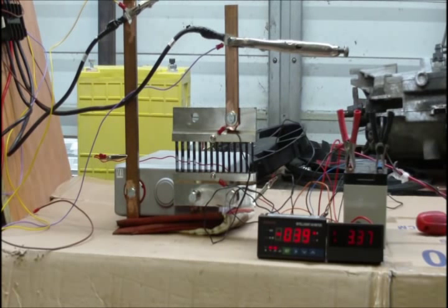And I have to say, just as a general observation about that meter, you may recall that when I was doing some headway cell testing that I was using a 1000 amp shunt, and I was charging at maybe 30 amps or so, and I was still getting quite good accuracy on it. Well, I don't know if you can see it there now, but the display is on current on the 404, and it's cycling between 39 and 40 amps, which is exactly what the CALB 6 is dishing out, and that's with a 1500 amp shunt on there. So certainly shows that the thing has the resolution to measure small currents even with a large shunt on there.